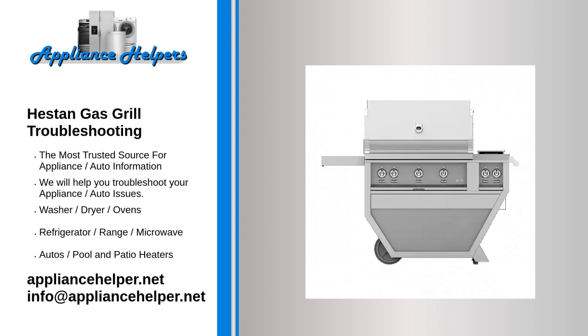No gas flow. You are either out of gas or your excess flow valve tripped. First, check for gas in your cylinder. Typically a full cylinder weighs about 34 pounds and about 17-18 pounds when it's empty. You can weigh it on a household scale, or better yet, use a gauge.